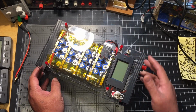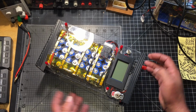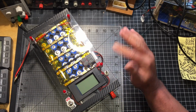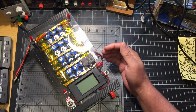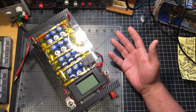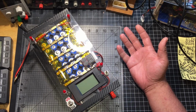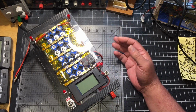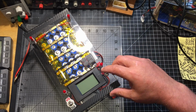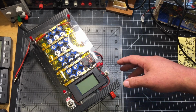All right, YouTube, that was my take on this portable adjustable battery. I made sure that I had some kind of protection. These little readers right here go up to 8S, and you can program them to send an alarm whenever the batteries get to 3.2, 3, all the way down to, I think, 2.9 volts. I just left it where it's at, at 3.3 volts, and you can turn it off or on, of course, so it's on. I still need to bottom balance it.